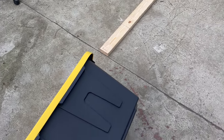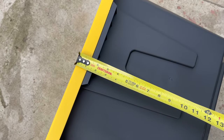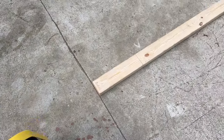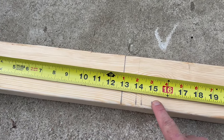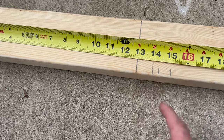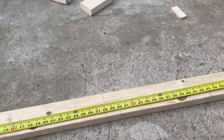I'm going to explain how far apart the bins will be when stacking them upwards. My bin is about 14 and a quarter inches tall, and the little lip is about two inches. I work with 15 inches per box opening, which gives me enough space top and bottom to slide them in and out. On the wood, I marked my 15-inch line, then two inches back for the lip — that's where I put my plank. The box slides on, has that two-inch lip up, and the cross brace sits at that mark. I kept the box opening consistently at 15 inches throughout.